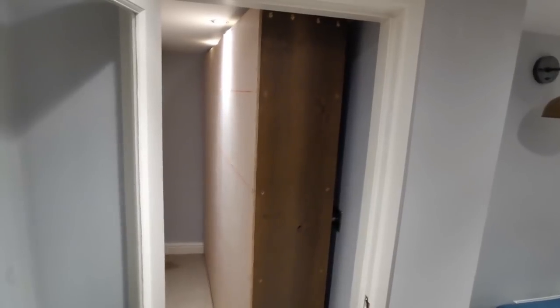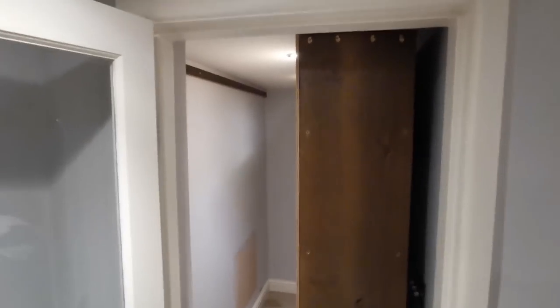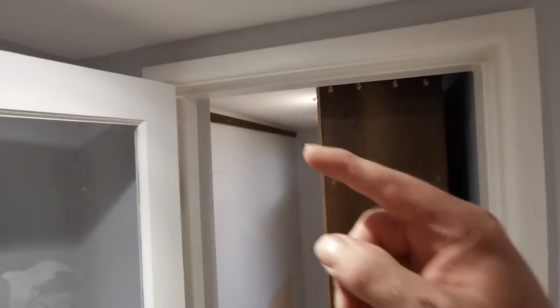Screws. Before I put these backs on, I made some pen marks where the shelves are, and my chalk lines on them, so that's alright. Chosen to screw it because this is a stuff shelf, you know, it's going to get your stuff shoved in it. And it's 9mm ply. I don't do 6mm for the few extra quid, you get a more solid back. Let's see if I can get it back in place. I'm also screwing it because I'm screwing it back to that.